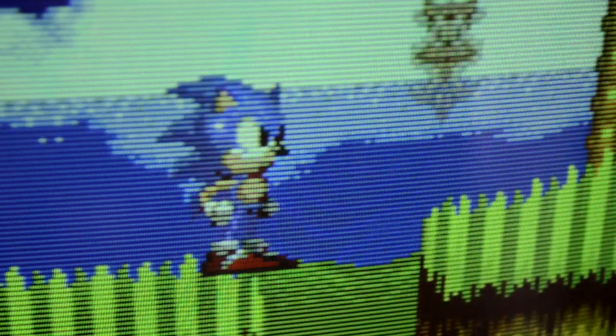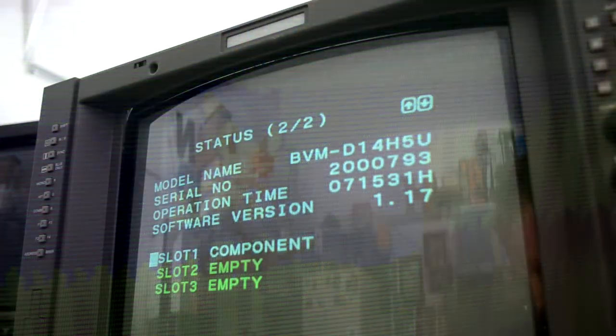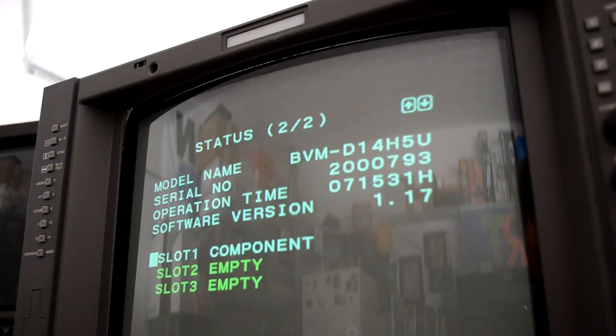The good news is this monitor does work, so a lot of the internals are still good. However, if we switch over and look at the menu and into the settings, we'll see that the actual hours on the whole monitor operation time is over 71,000 hours. So that tells me again that the tube is most likely worn out and we need to get a new tube into this. So again, the monitor didn't have the tube, it didn't have a bezel, so I do have